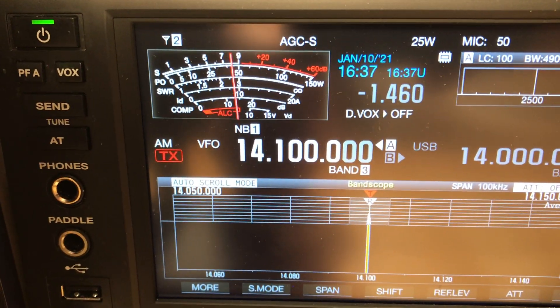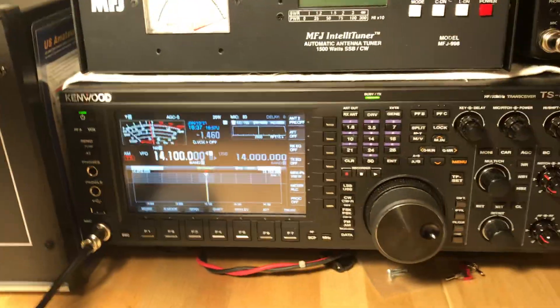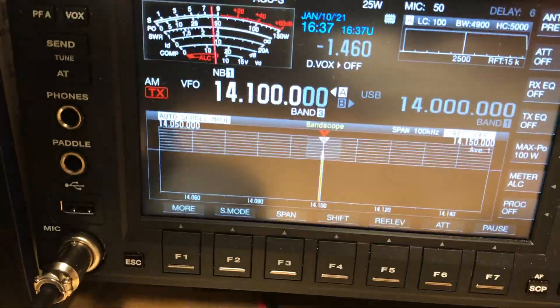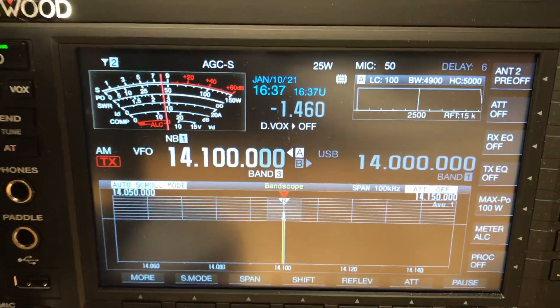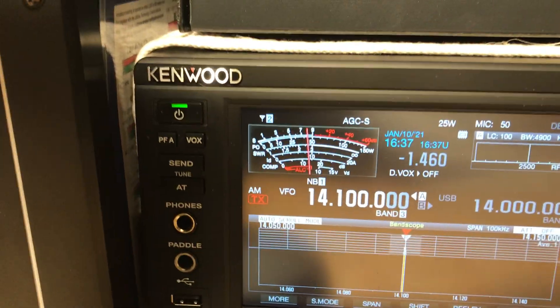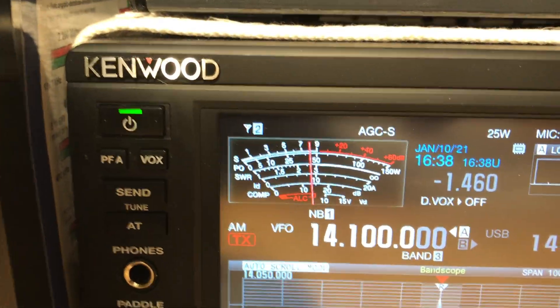I got to thinking I should look at the procedure. Looking at the service manual for John's ICOM 735, it said no carrier AM — which is what we have. But then I got thinking: how many people actually do AM? When we give RST reports on sideband, are we reporting on dead carriers or some average modulation? Technically, if we're looking for RF signal units — supposed to be 6 dB per S-unit — then yeah, this reading would be a little low.